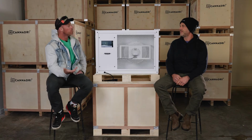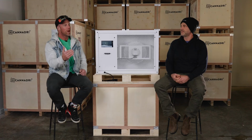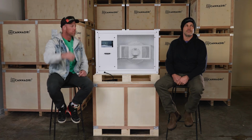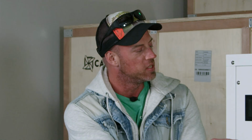And we had one of the bigger cannabis players in the Canadian market that was using a competitor's product. They were curing their product at 55, 56 degrees. They were saying their dehumidifiers only got 2-3 minutes of runtime dehumidification before going to defrost, right? Almost completely useless. They were showing graphs because they've got a sophisticated building automation system, and they're showing all these graphs of these big spikes. And so I said, well, try one of our dehumidifiers, see how you like it, right? And I said, here, we have an advanced parameter setting where you can set it. In that case, we had the defrost temperature set at -4, so you get way more runtime. And I think even in that situation, it was just over 30 minutes of runtime before it would try to go into a defrost, right?